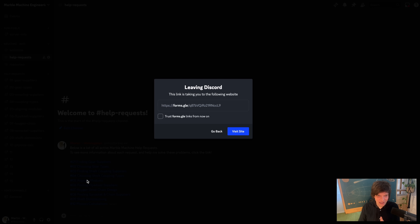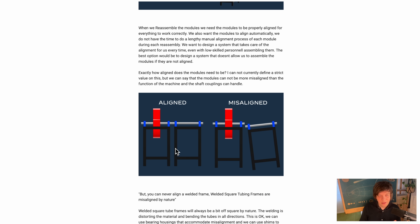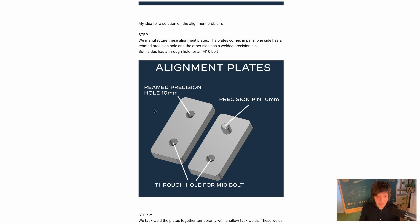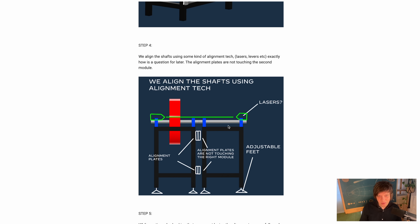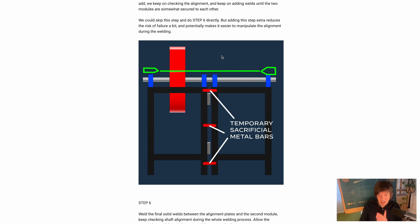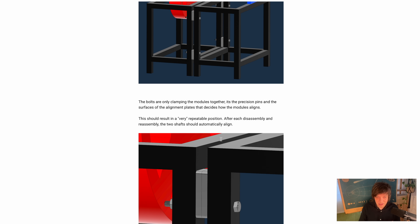Here's a really interesting one: aligning modules. I made a big write-up on this request, introducing the problem with all my thoughts and establishing exactly what the problem is — how we can align the modules perfectly each time after disassembly, because we have to disassemble the machine between each concert. My idea: we make alignment plates with one precision hole and one precision pin. We temporary tack weld them, weld them solid on one module, align the shafts using alignment tech — SKF has really cool cheap alignment tech for shafts. When it's aligned, we tack weld the modules together, check alignment, weld it solid, and remove all the tack welds. Now we can separate and reassemble the two modules with perfect alignment every time.